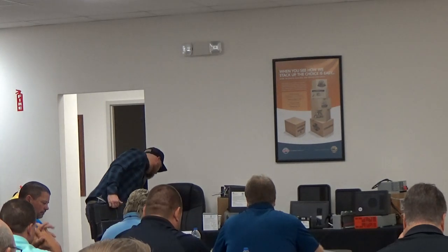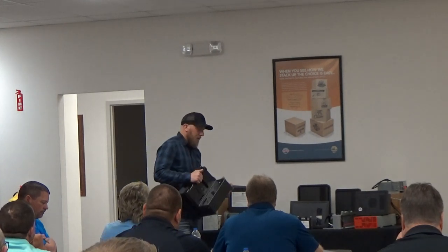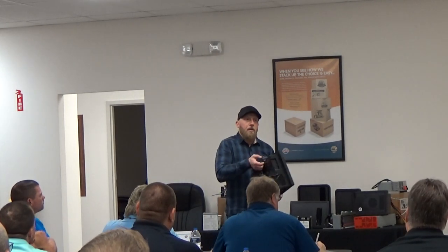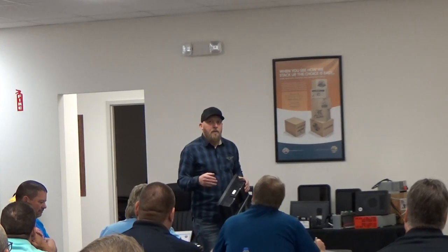Last one on here is number 7, is converter keeps shutting down. And that goes to the cooling of the unit. It has the over temperature protection like we talked about with all of our products. This one sucks supposedly cold air through the back and blows it out the front. But if this is in a compartment where they can throw their coat, or the factory just installed it in a very small cabinet, or under maybe one of the benches where it doesn't breathe that well, or they install it next to the furnace motor like we've had some of the OEMs do, once this gets hot, it will shut down. So their lights can be running healthy and fine, and then all of a sudden it goes black, and then 10 minutes later, all of a sudden the lights are back, and everything's working like it should, and they'll go through this cycle all day.